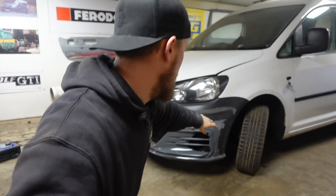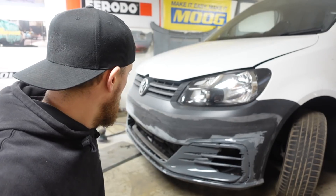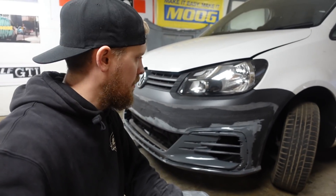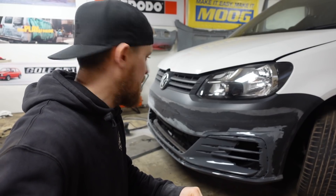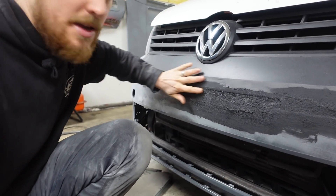Good morning, welcome back. The filler has gone off, it's all nice and hard now. I've had a bit of a go with a sander to see how it sounds. The plan now is to go over and sand it, get all the high spots off, get all the bits where it's built up and faired up down flat, give it another good layer of filler, and hopefully we'll be starting to shape it. You can see the filler's dipped in a little bit and that line is still visible, so a quick sand, a bit more filler, and we'll see what we get.